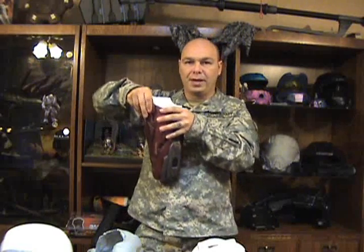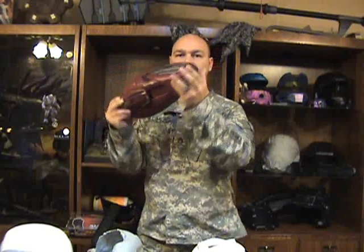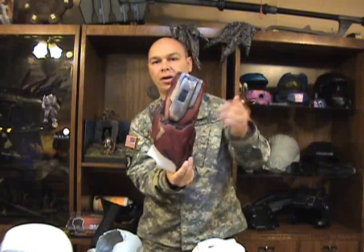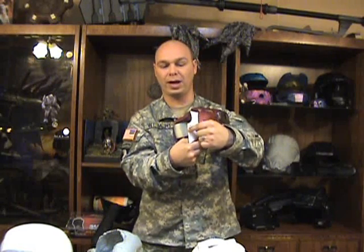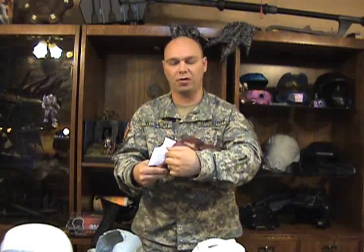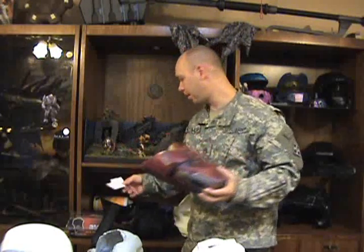When you do your mold now, the rubber will cover all the way up to here. You have this closed off, so it's going to be sitting like this when you put your rubber on. Pour your rubber on, brush it on. It's going to pour all the way down to the edge of this paper. Then when you put your shell on, your shell's going to go all the way down to that point as well. So when you're casting, you're going to take it all the way to this edge right here. Now you pull your rubber off and look at it. It's going to look like this, but with a lot of extra flash. You break the flash off, or you Dremel it down to the appropriate edge, which is now thick because you overshot it by a lot. I hope you all understand what I mean by that.